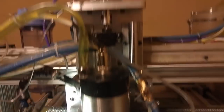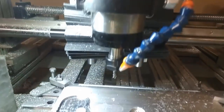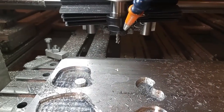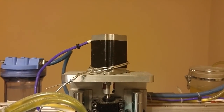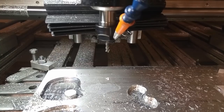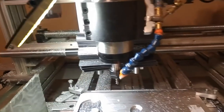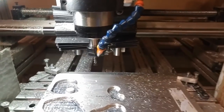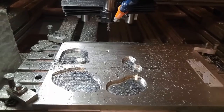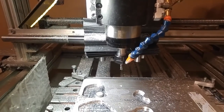I know what was going on — this motor is designed for around 24 to 30 volts and my power supply runs a little hot at about 38 volts. I noticed it was getting really hot, to the point where I could smell the insulation on the wires inside. So I had to turn down the torque — the amps the stepper driver produces. I also had the machine set to move at 100 inches per minute, which for this thing is way too fast, and it was starting to skip steps due to sudden acceleration. I turned down the speed and we should be good from now on. Look at that — it's looking pretty good.